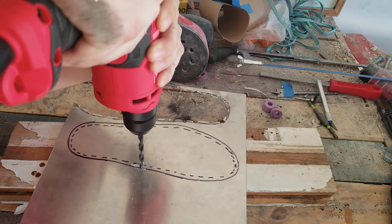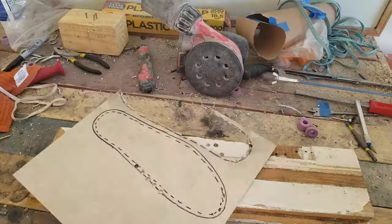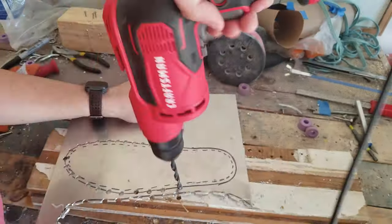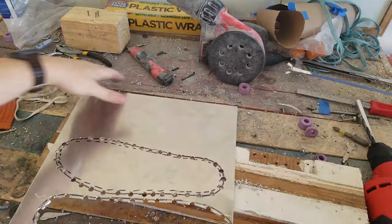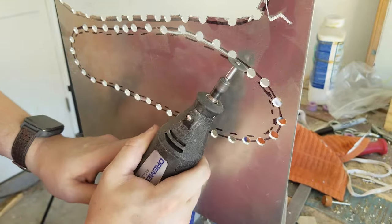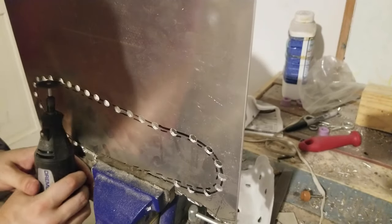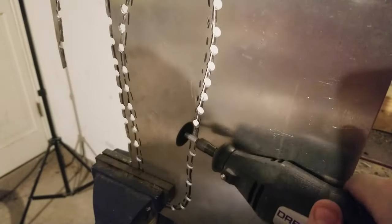I don't have that — I have a drill and a Dremel. So in order to get this shape cut out, what I did was drill along the outline at various intervals. Because I'm going to be standing on this plate, I didn't want to feel those little cutouts around the edges, so I kept as close to the edge as I could while still making sure it overlapped my line. Once all the holes were drilled around the circumference, I took a Dremel with a metal cutting bit and went through in between every single one of those holes along the outline. This process took a pretty long time and I chewed through a bunch of those attachment bits. I do know it was not the best way, but it's the only way I had access to at the time — so it was that or don't have a pair of skates, and daggummit, I wanted a pair of skates.